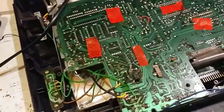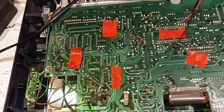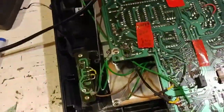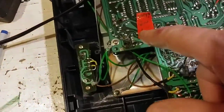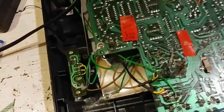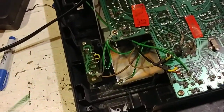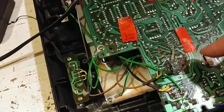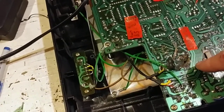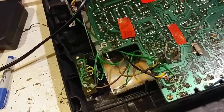I've been all over the ICs, verifying that they work right. There's some hex inverters here — they're fine. There's a quad op amp that's used — everything looks good. The 4051, all the switching on it works right. The only thing I found was this one bad calibration point, a trimmer VR4. It's involved in calibrating the DAC.